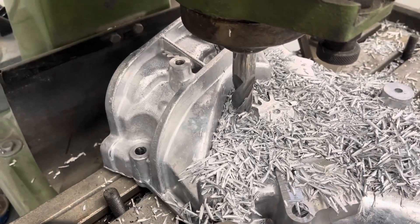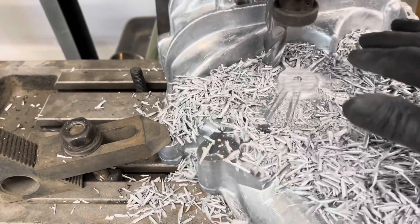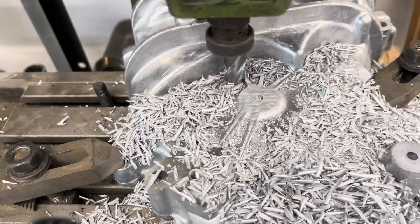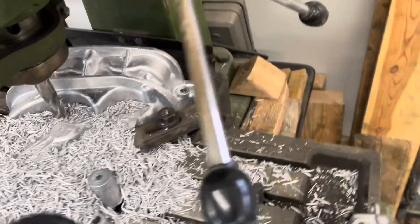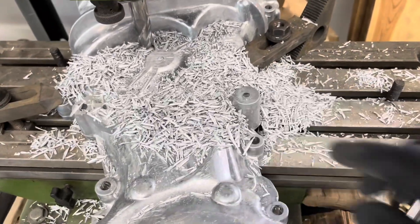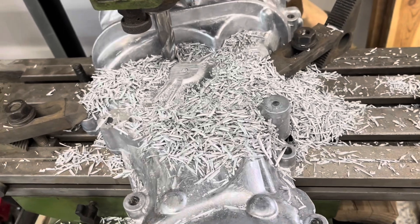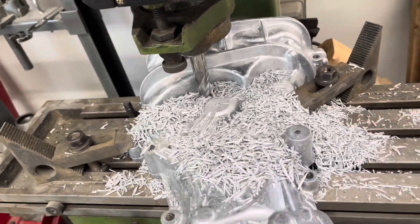Talk about making some chips! That's probably going to go down a little further than that and then I'll have to refixture this thing. I actually had a piece of wood stuck in there but it still wouldn't travel enough to get to that boss. So I'm just going to finish that up, get to the last boss, and then see if I have a ball mill or I'm just going to make a square slot where it's required.